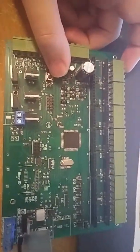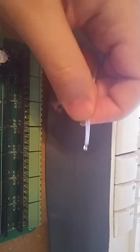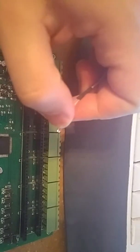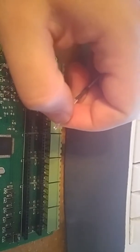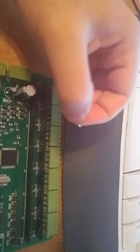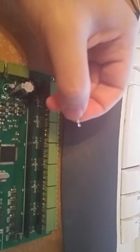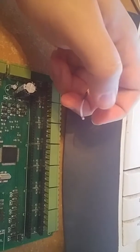If you've done that and still have problems, check the connectivity of your sensors. This is a temperature sensor — as you can see, there are two wires that are bare just right at the tip. When you put this into the heater block and bend it and place it there, when you tighten the screw it is possible that these two wires touch each other or touch the frame.